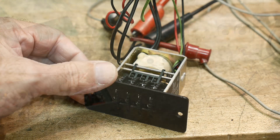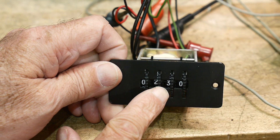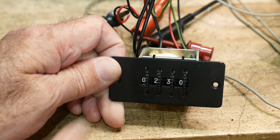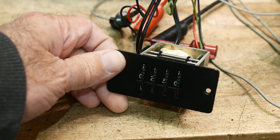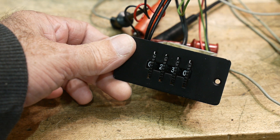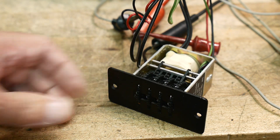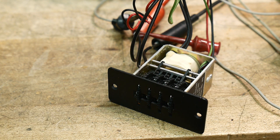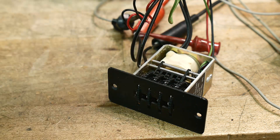This is a counter — it's really cool. You can set the number with these little thumb wheels and it's got a solenoid in it. It's a down counter, not an up counter — I've never seen a down counter before. So you can set a number and then it counts down. There's a switch so you can have it time something. It's a number of AC cycles — it runs on 110 AC.